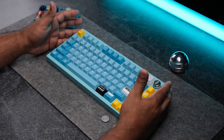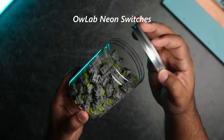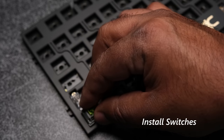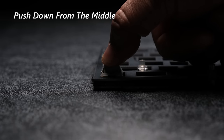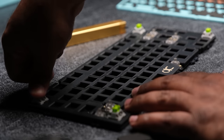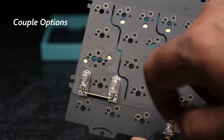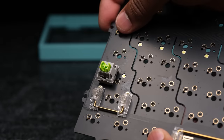Now it's time to insert your switches. The switches I'm using are the Owlab Neon switch, which are long pole and super clacky. The best way to do this is to start at the corners so you know that your plate is in complete alignment. Make sure the pins are straight and press in from the center until the switch clicks in — you should see it coming through from the bottom. Once you have the four corners installed, continue to install all of the switches. If you go with the try mode, you can select either a step caps lock or a standard key, as well as a split backspace or a standard 2U backspace.